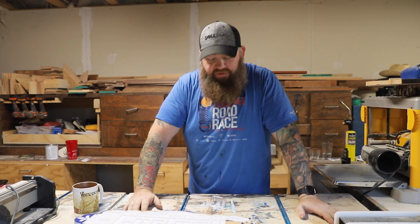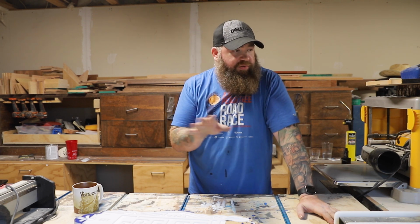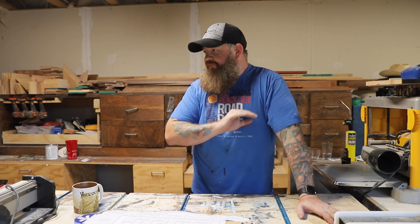So what we're gonna do today, from all of these lessons learned, and apparently the moment I started using my CNC machine, I completely forgot how to finish wood. We're gonna cut it to size. We're gonna put 2 coats of shellac on it with sanding in between. Then we'll paint it, sand it, paint it. So we get a really super nice finish on it.